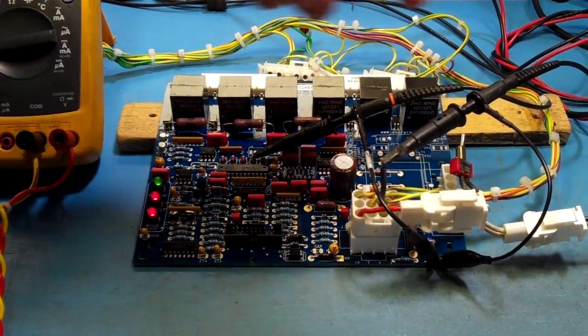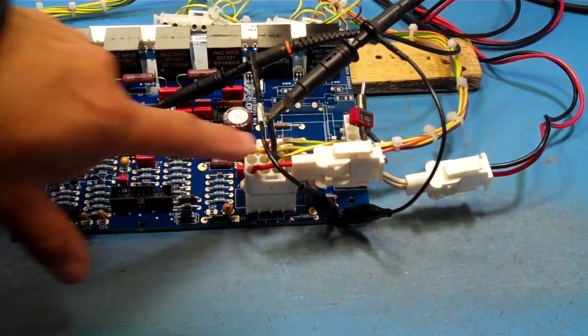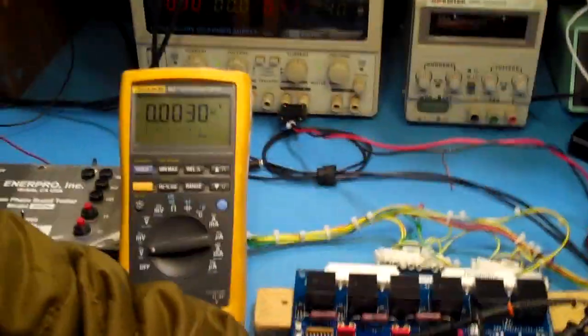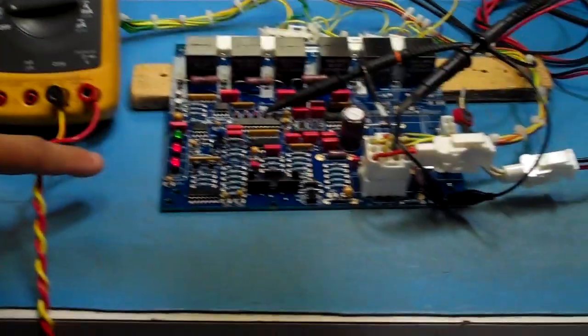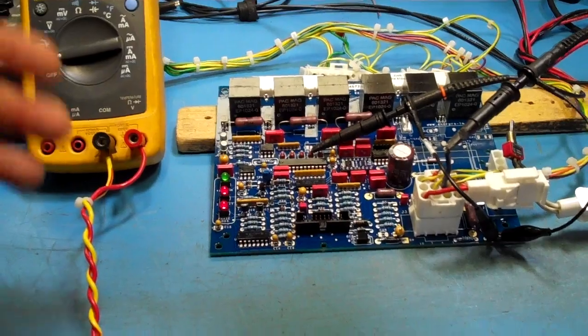Now, here on this channel 1, we are monitoring on J3 position 5 the phase loss, because we have a jumper on J6 between positions 3 and 19. So right now, we see that this signal, it's low. It says I have a phase loss, and we see that it's not moving at all. And we see that here the LED is not flashing, is not blinking, or at least we couldn't see it. So we're not counting on our eyes, we're looking at this.